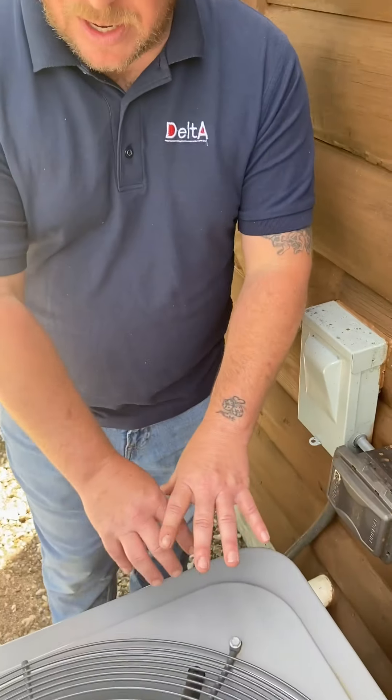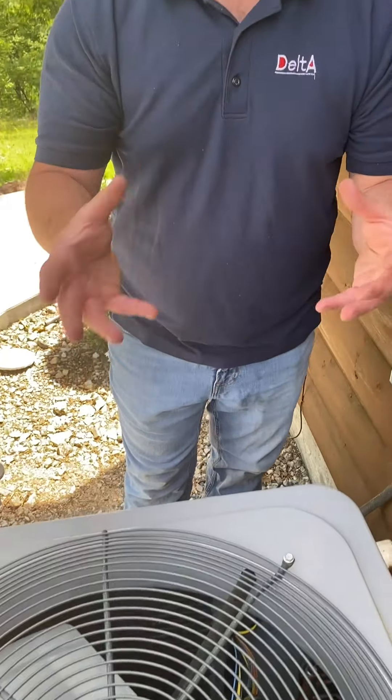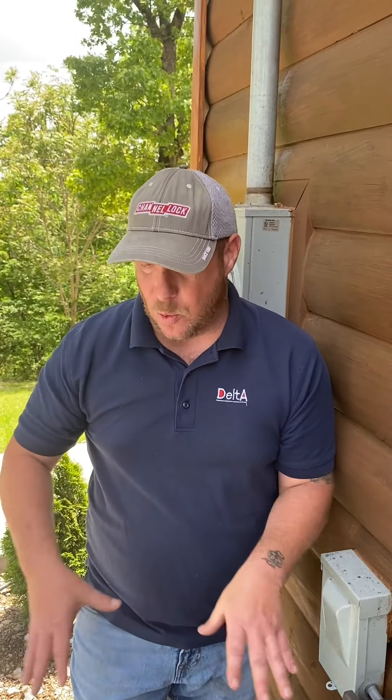Just be aware that this unit is a big coil. This fan pulls air through that coil, and anything you introduce into the atmosphere around this coil while it's running will get pulled in. That coil can become impacted, meaning you'll have to pay an HVAC professional to come out with harsh chemicals to clean it.